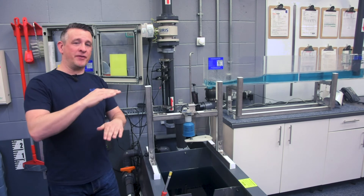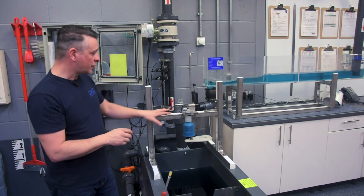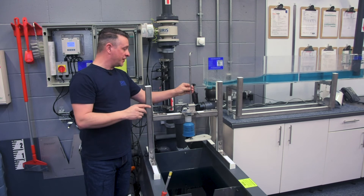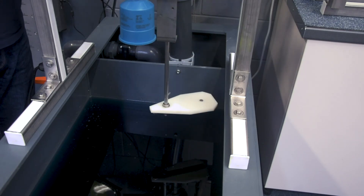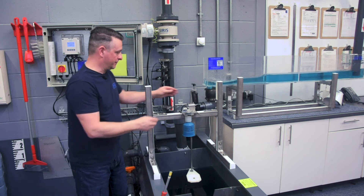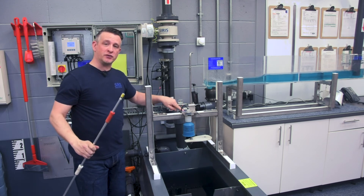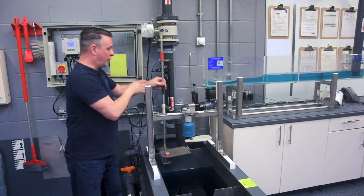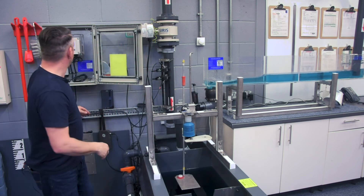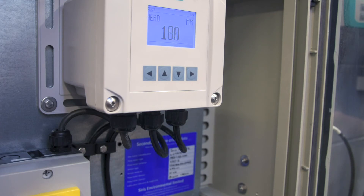The most common method of actually measuring the depth in a flume is to use an air-ranging ultrasonic sensor. We haven't got one above the flume, but we've got one here above the V-notch weir — the principle is exactly the same, it's simply measuring the depth of fluid. There are two basic methods. One is a fixed calibration plate: the plate swings down under the path of the ultrasonic sensor and we know what that plate is set at, so we can simply read off what the flow meter tells us. Another method is to use a portable calibration plate. This bracket arrangement has a clearly referenced colour — in this case black — so I put the black collar into the mount. The plate is then in the path of the ultrasonic sensor so it's now reading a different depth. The sticker here tells you what the calibration reference height is, and we can then see that on the flow meter after a minute or two once it settles.